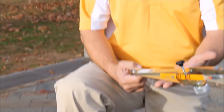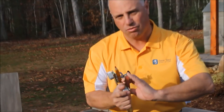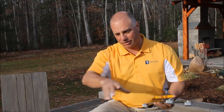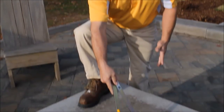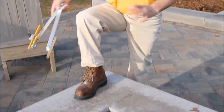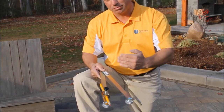Originally it was created for that. We've also used it for marking in your sailor's row or header row on a paver — say a pool patio. You're going to run a border around the entire pool patio. Set this to the width of your border stone, ride this right in your border stone, and drag that along the entire coping. It's going to mark your six inch or whatever you have for a border. Make your saw cut, drop the block right in.